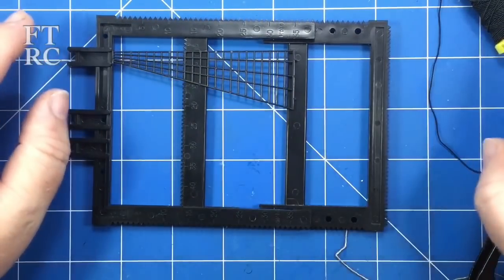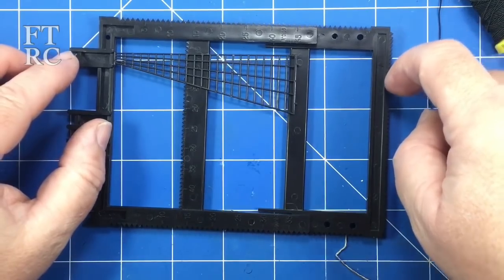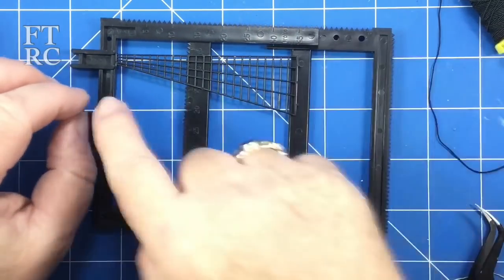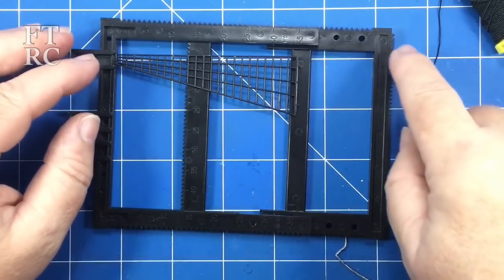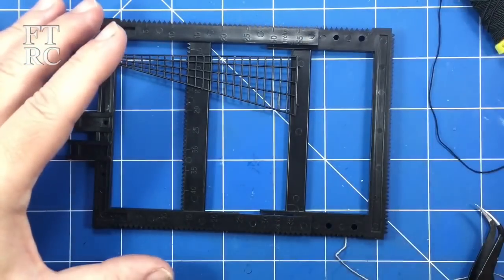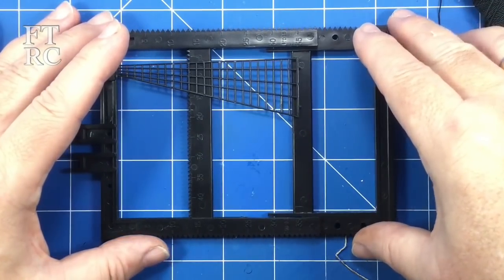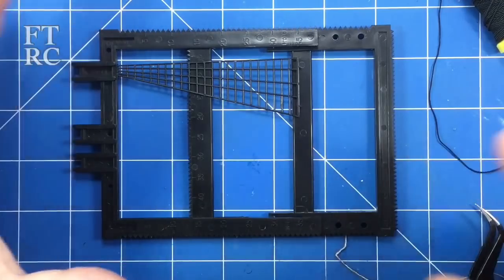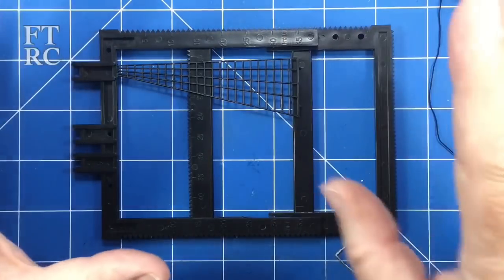By changing the length, it'll change how you use the grooves, because obviously you're triangling out. So if you put your rule up, if you're doing your own, and the grooves don't really match, you could try a slightly wider or slightly narrower setting, and that will change the positioning of the grooves relative to the triangle that you're making. It's all trigonometry. Don't worry.